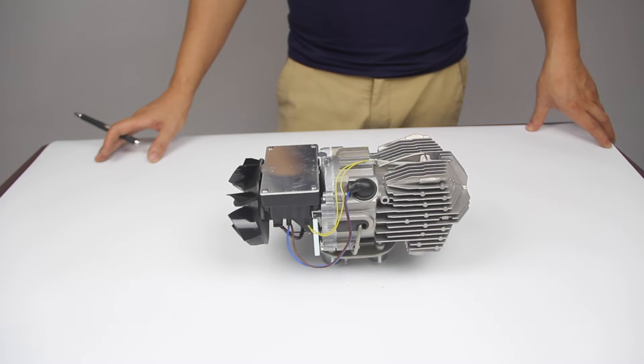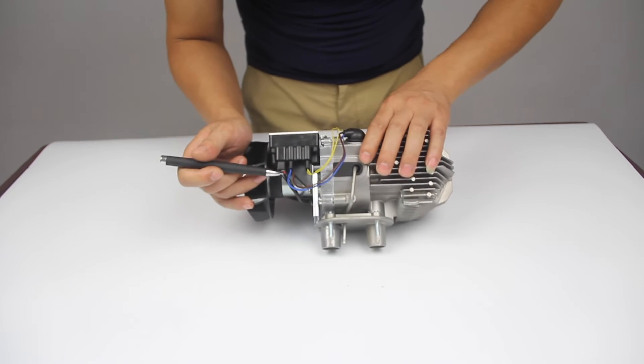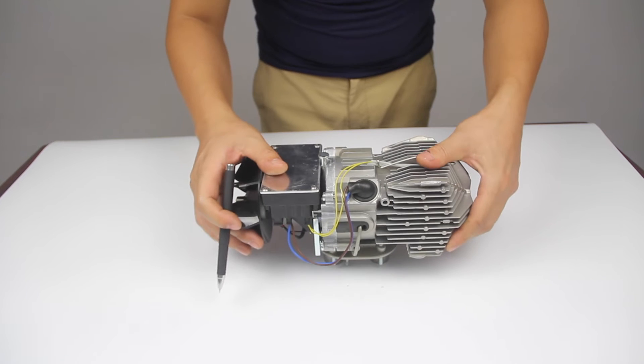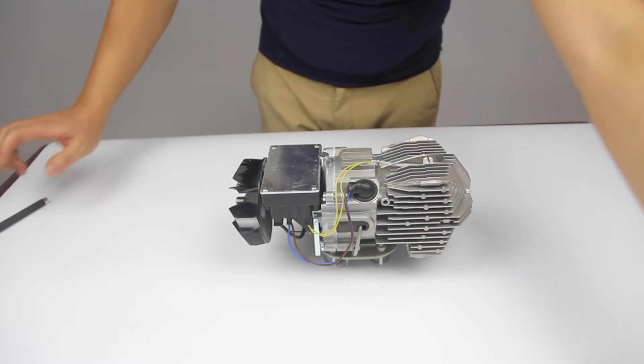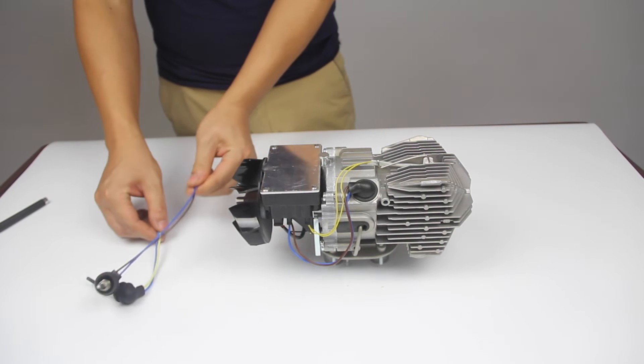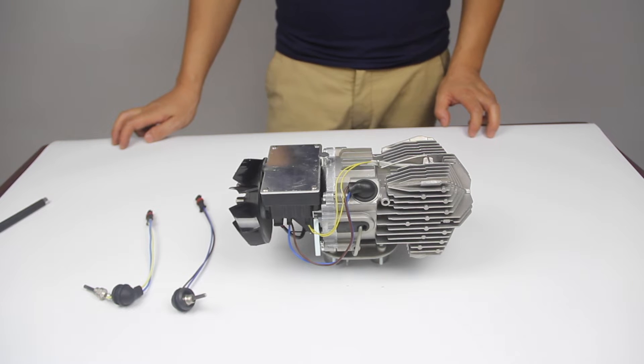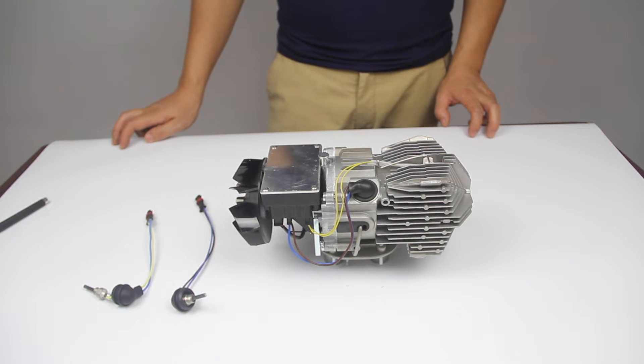To fix area 4, we need to check these two places. First, please check whether this plug is loose or not. Second, the power of the ignition plug may not be enough. Please don't apply a 24-volt ignition plug on a 12-volt main engine, or a 12-volt ignition plug on a 24-volt main engine.